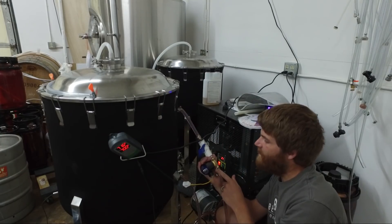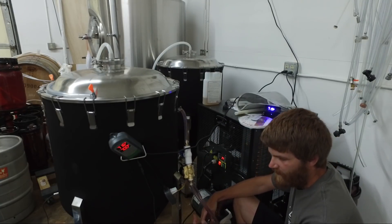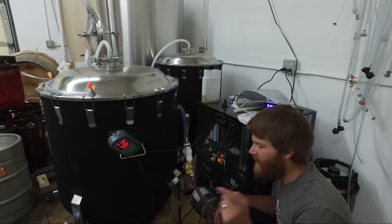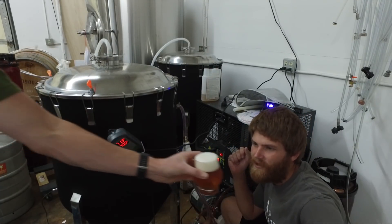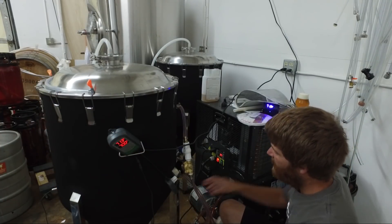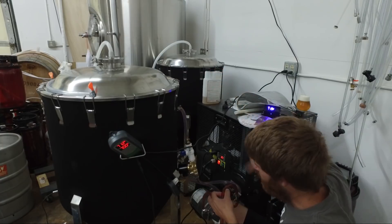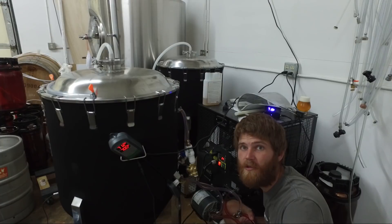So here's the one that we've got hooked up already. Right now I'm going to tie into our glycol line. Currently we've got our high line coming off of here and our low line coming off of here. That is the chilling coil to our bright tank — hey, I got beer. So we're going to go ahead and hook up and tie into these two glycol lines and hook into the fermenter. This is going to be a complex process, so I'm just going to go ahead and do it and show you when I get back.